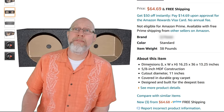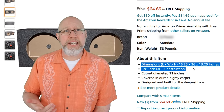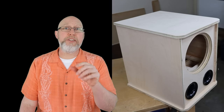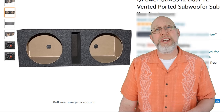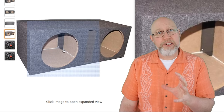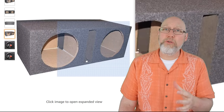So what's wrong with this box? Well, to start off with, this box uses 5/8 of an inch MDF. Now there's nothing wrong with MDF — MDF is a standard material we use for building speaker boxes. The problem is the walls are simply too thin. 5/8 of an inch is just a hair thicker than half inch. The standard is 3/4 of an inch MDF with a double baffle. The walls on this box are just too thin. The box is going to flex, that's going to reduce your bass output, and it's not going to sound good.